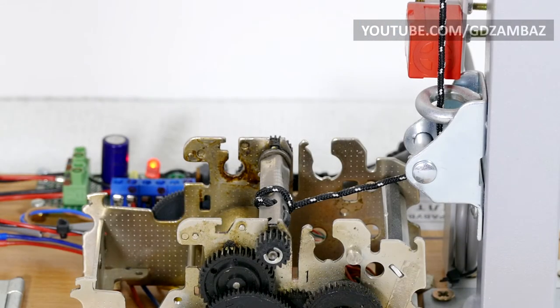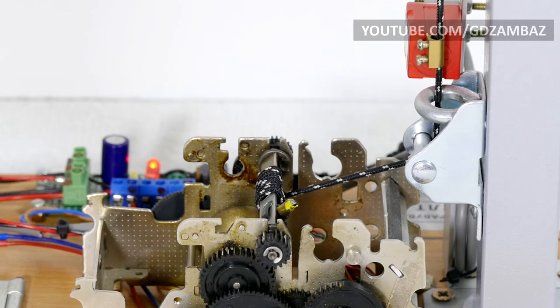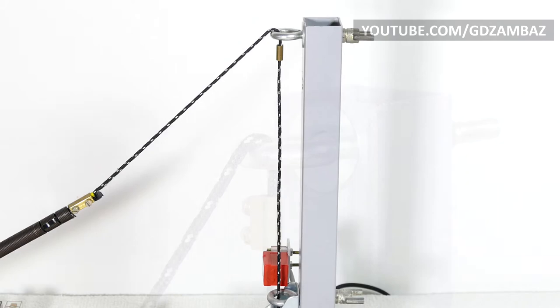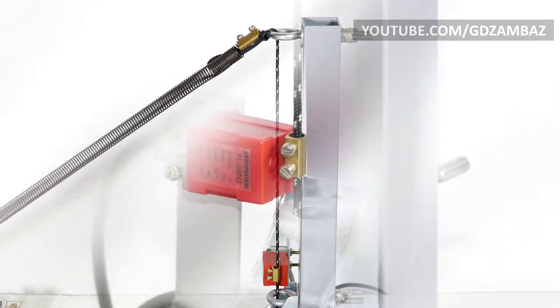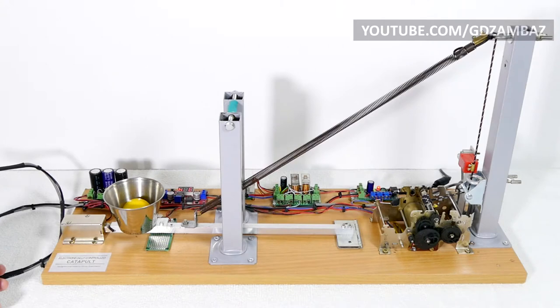The stretching of the spring is accomplished by winding the string on the shaft, and it's initiated only if the arm is returned to the base. The extent of stretching is determined by the position of a small brass connector through which the string is pulled. During the winding, the brass connector moves downwards with the string. Once it gets close to this sensor, the end position is reached and the winding stops. At that moment, the body of the spring is extended to 39 cm.